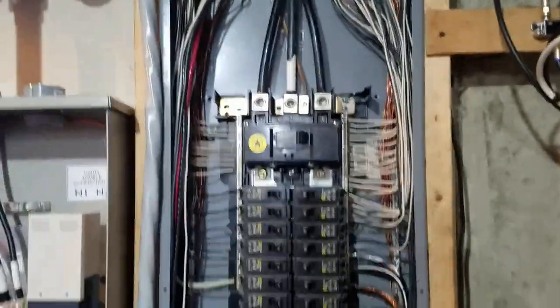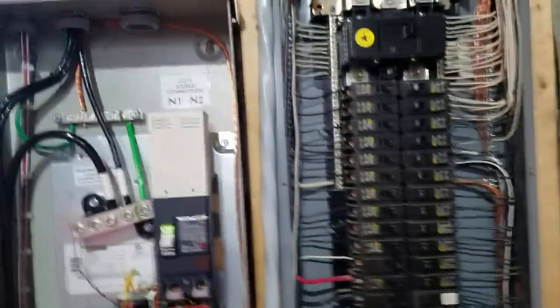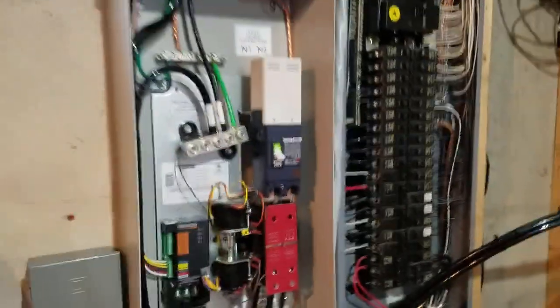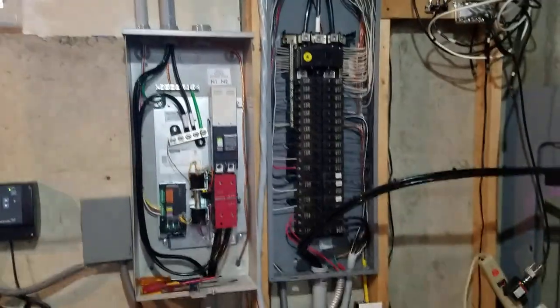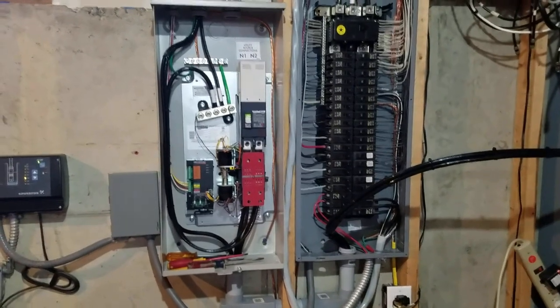That took about an hour and a half but it looks good. These are my feeds — once we have a power outage, or once I decide to pop that meter and put that little section in up there, get that meter to come down on top, it'll be done. That little green bonding screw has to come out too, but I'm going to leave it in for now because I'm not quite all the way there yet. There's still a little stuff to make it all code-ready and legal. Making good progress — I'm hoping by this weekend we'll be doing a startup on our 22KW Generac generator with the 200-amp ATS.